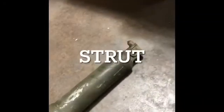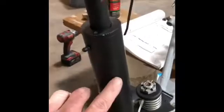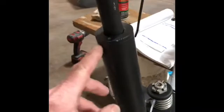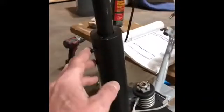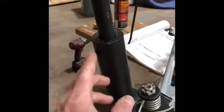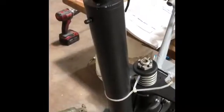Hopefully that's it. Here's the other old, original shock that goes in it. It's a little bit different configuration. It will work in here, but this more modern shock should have a bigger, heavier spring. And I put this on here this way, rotated it, actually located it this way because of this Zerk fitting, but that may belong on the inside, which would make sense and protect it more, but we'll see. Be back with you in a minute.